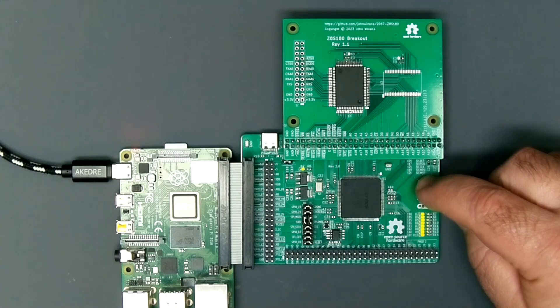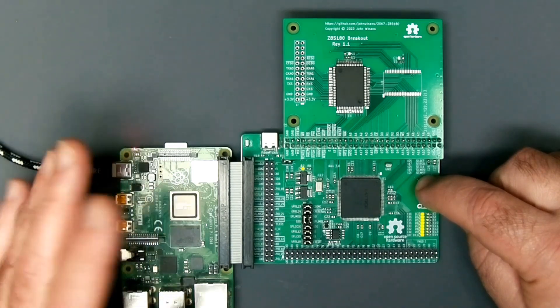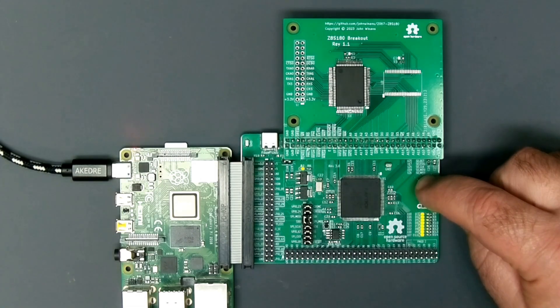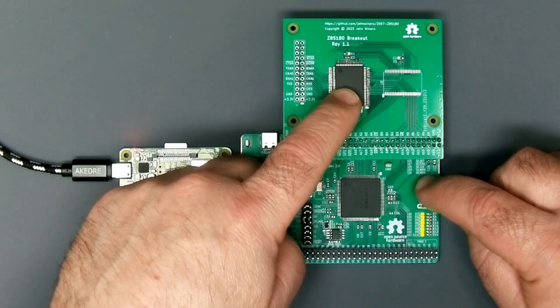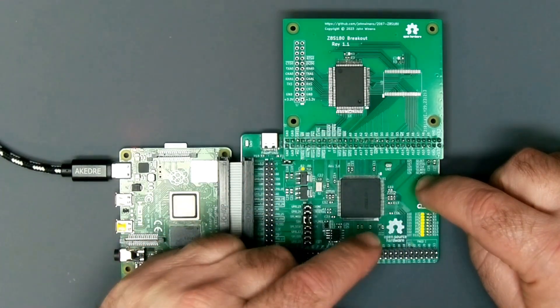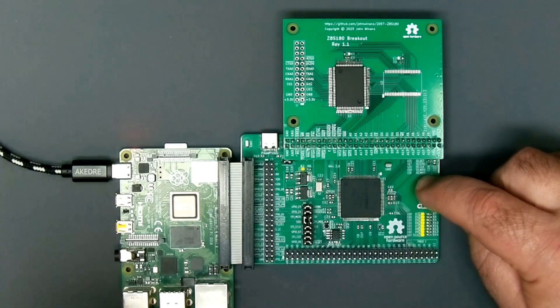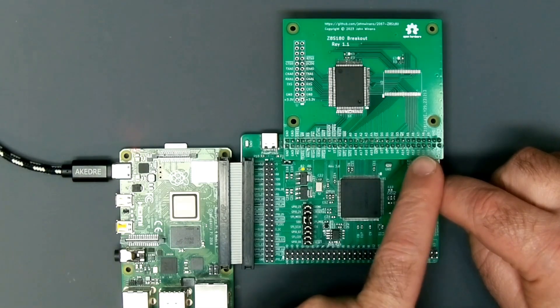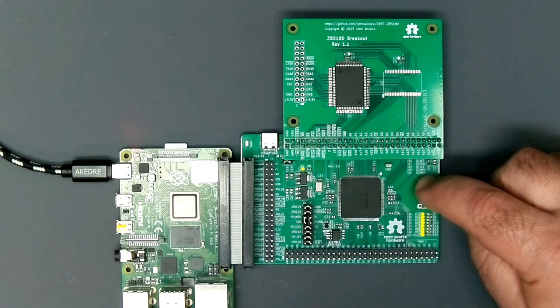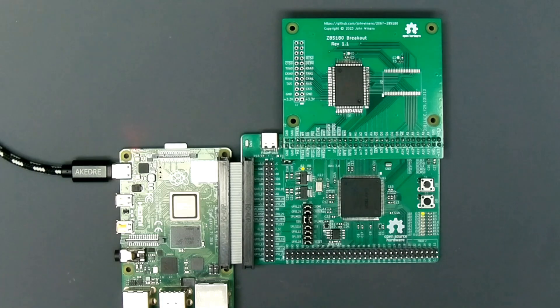Here is me resetting the board. Now keep in mind this clock is running insanely slow - divided by the 22-bit value, it's probably running at like 12 or 16 hertz. And remember, that's divided by two before it comes up with the phi clock that the main processor uses. If you read the spec, you know that the reset signal has to be asserted for many many cycles before the Z80 is fully reset inside. While I'm holding it down you can see that the address lines are all high - they're floating and pulled up, so it makes sense they'd all be ones. I rigged up the A bits through the FPGA to these LEDs. When I release this, we should see it start counting as it fetches from address 0, 1, and so on.